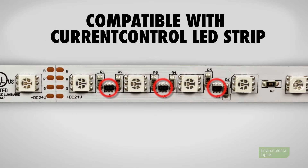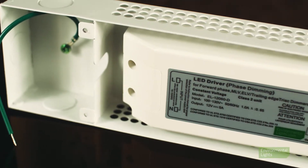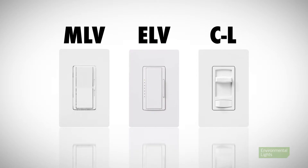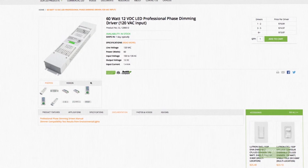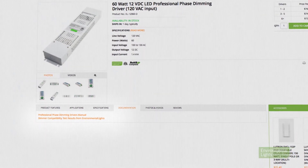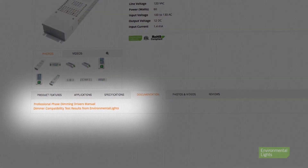The inputs to these drivers have been designed with adaptive circuitry that works exceptionally well on many popular dimmers, including MLV, ELV, and CL models. Compatibility with CL dimmers is especially beneficial due to their low cost. A full list of verified compatible dimmers can be found in the dimming compatibility chart.